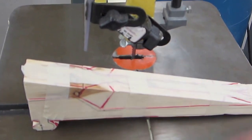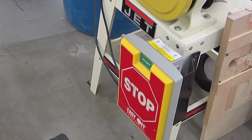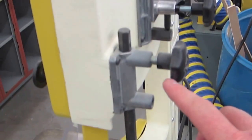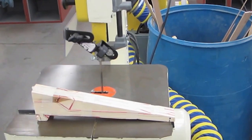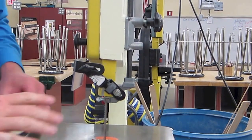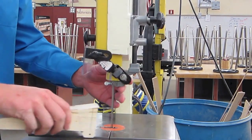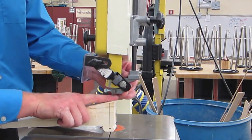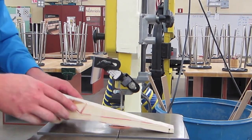Here's my car, I'm ready to cut the top view on the bandsaw because the scroll saw can't cut that. The bandsaw has the same big start and stop switch as everything else. This part is the blade guard, and this part in the back - if I loosen it up I can raise and lower the blade guard. Mr. Han told me a quarter inch above the workpiece. I have to be at the high point of my car - put my finger on top of the car, put the blade guard on there, and lock it. Perfect - now the blade guard is set up.